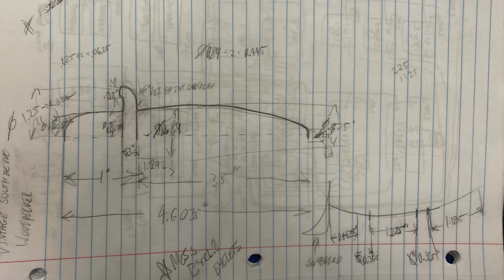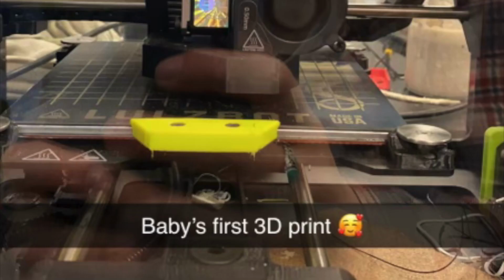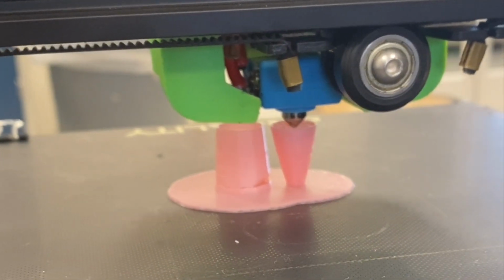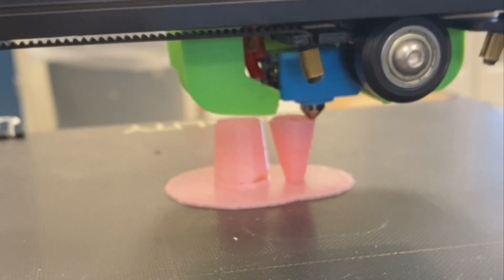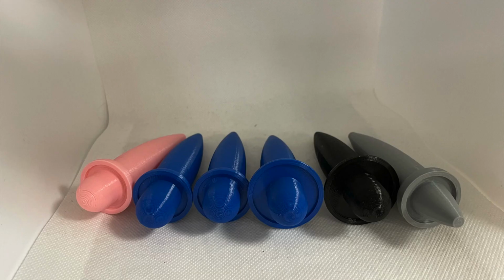For design, we took measurements of these lures and we mocked them up in SolidWorks. After we mocked them up in SolidWorks, we were able to get a better version of what worked and what didn't when we used the 3D printers to rapid prototype them. Rapid prototyping on the 3D printers allowed us to see everything that needed to be changed, what worked, what didn't work, which was super helpful to visualize for anything that was needed to go further with in the project.